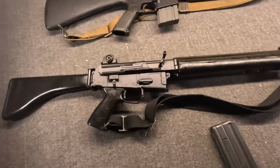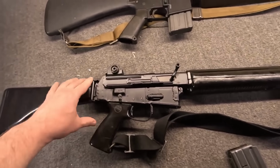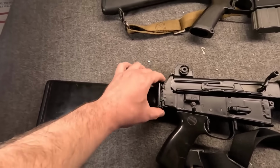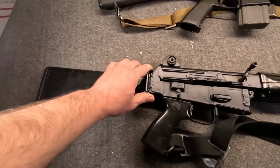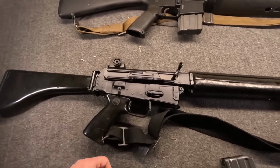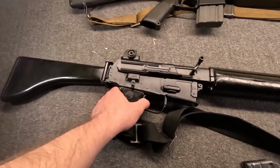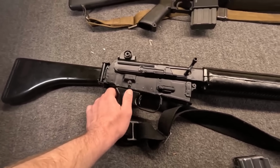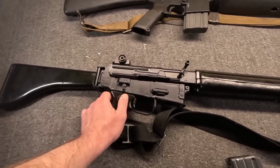So what happened? Despite a couple of positives, what the Army found was there were some pretty major weak spots. For example, the bracket that holds the stock on is just welded on. It's quite vulnerable. The way it folds, just squeezing in these, is quite weak. The last round hold open, that catch is very weak. I can attest to that firsthand. I will also say the trigger on these is not great because it's made with stamped components and castings versus any type of forgings. I've seen people try to improve the trigger on an AR-180 and end up just completely butchering it.